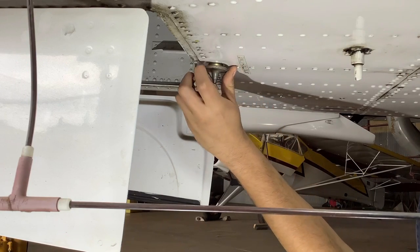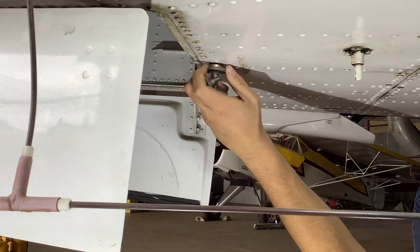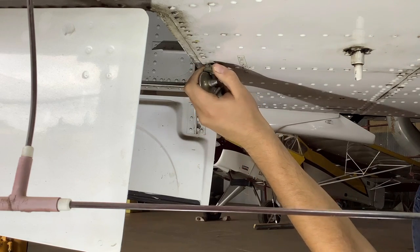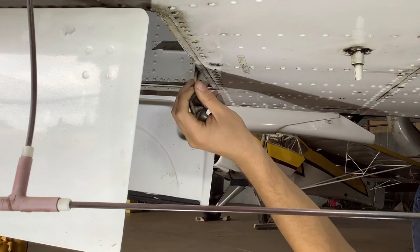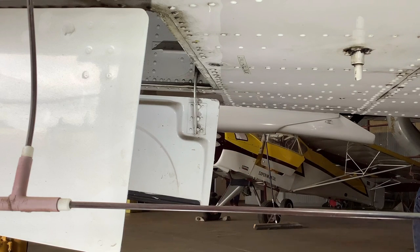Make sure you remove all the jack pads on the aircraft. If you don't, they will unscrew themselves and fall out. And guess how much damage they'll do when they hit a car in Mission Valley. One jack pad was left on many years ago. It fell off in flight and it went right through a brand new Ford Mustang, through the roof and through the floor and into the pavement. So always remember to remove the jack pads. If they hit you in the head, you're gonna be in big trouble.